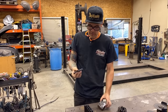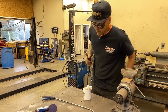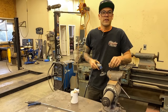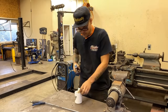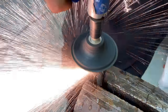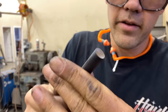It corresponds with our transfer punch. We're going to grind the end of this off flat and sharp. I'm just going to use 80-grit on a three-inch grinder. One thing you want to make sure of — you want to keep this cool as we're grinding it, just a little bit at a time, because this is tempered and hardened so it's made to punch something. Just grind, keep it cool with a rag, grind until we've got a nice sharp punch. The edge is nice and sharp.